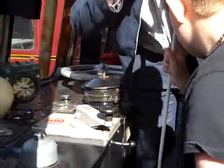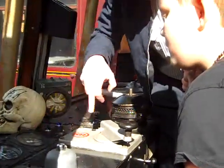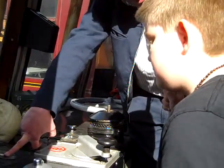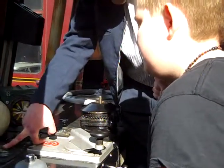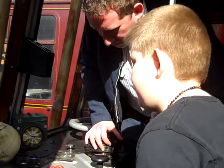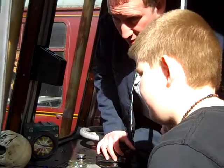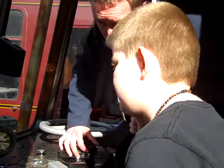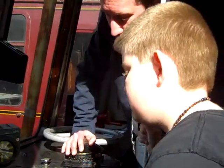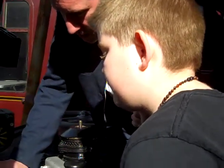Well, the engines will start, you see. The engines are fine, but then you can't control the engines until you've got air pressure, and the engines themselves drive a compressor, which is something that builds up the air pressure. No, the engines will start. They're pretty good at starting. They're straight into life, but essentially you can't do anything with them until it's built up.